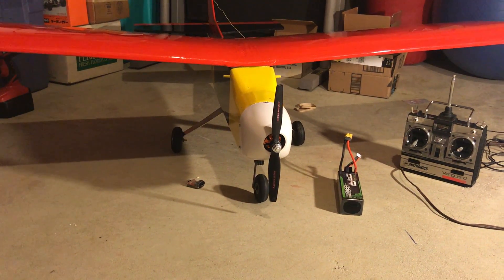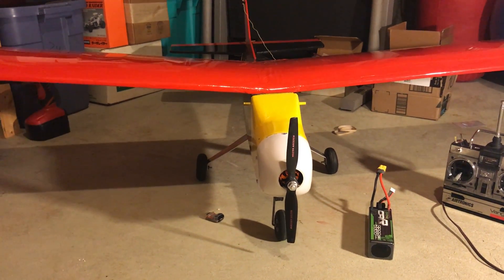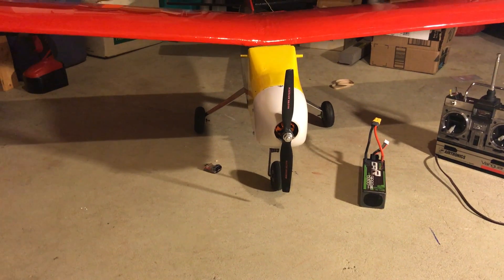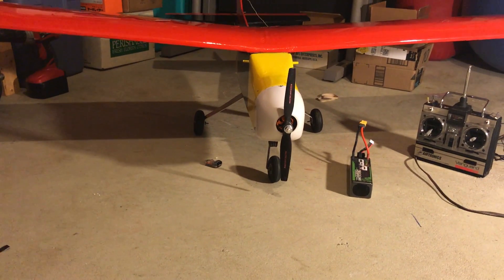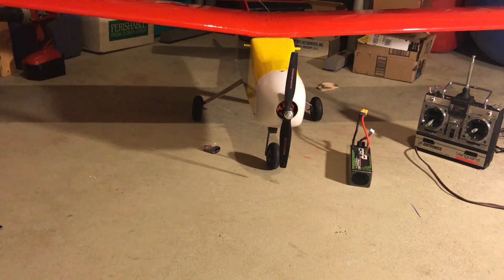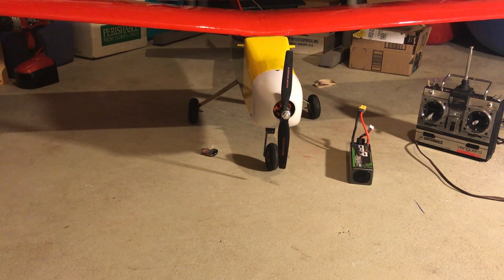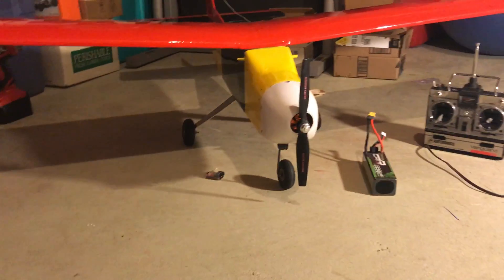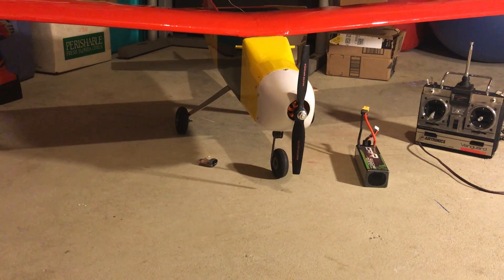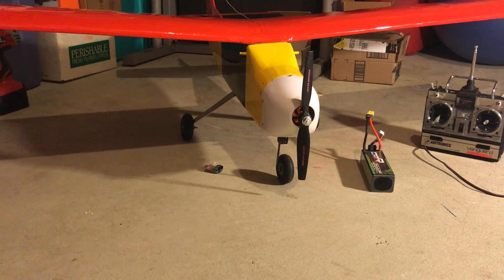With the same brushless motor it would make closer to 700 watts on 4S. I'll put a link in the description — there's a Cobra motor with a lot of prop info that's almost identical, and I used that to dial in the prop I wanted. I'm also considering a three-bladed 10x7 prop; the power number should be about identical to the 11x7 two-bladed prop, but they're kind of expensive at ten dollars and I wasn't sure if it would be a good idea starting out.